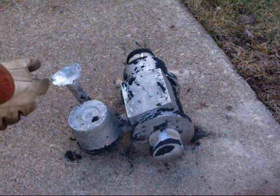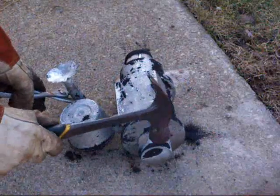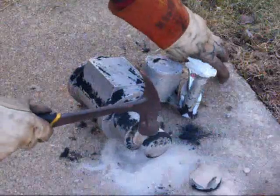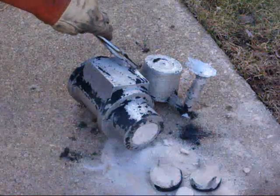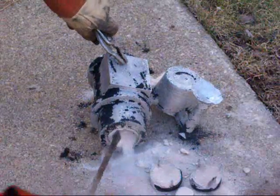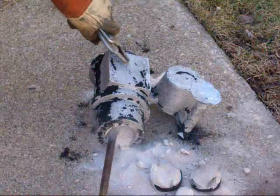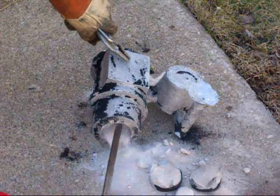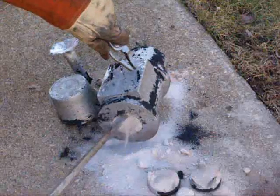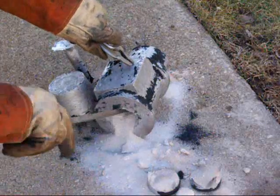This is the first warm day of spring — it's the first week in March and that's why I poured this today. I'm going to knock the ends of the cores off. And the core has become rather collapsible now that it's burnt out, so I will just gouge it out with this huge screwdriver and we'll have a pile of sand. That is one of the features that you want in a core: collapsibility. So you can see this is rather collapsible, but it's still going to be a chore to get it all out.